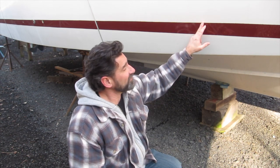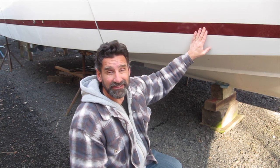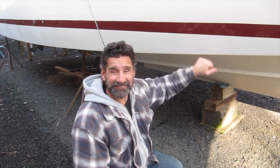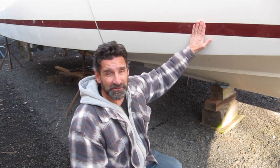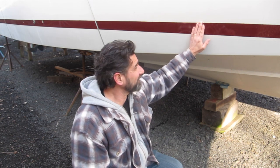And how I did that was, I talked to the fiberglass guy here. He's like, well, you gotta grind them out. You can't just paint over them. They're just gonna come back again, and that's not gonna cure it. So I took a Dremel with a diamond kind of bit on there, ground it out, filled it with an epoxy that was good for above and below the waterline, and sanded it, and that was it.